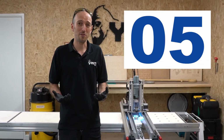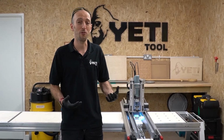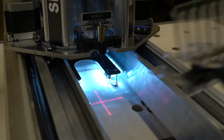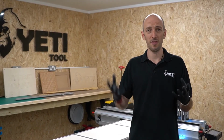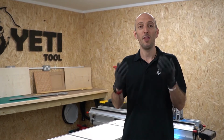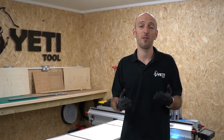It does go without saying that you shouldn't put your hands anywhere near the spindle when it's on with a cutter on it. And on that note, whenever you're doing a job, make sure that your dust shoe guard is in place. If you're cutting anything that generates particulates in the air, you want to be really careful that you're managing that dust. Your two options are making sure that you've got a Class M extraction system, or that anybody entering the environment wears a suitable grade of face masks to prevent them from breathing the dust into their lungs.